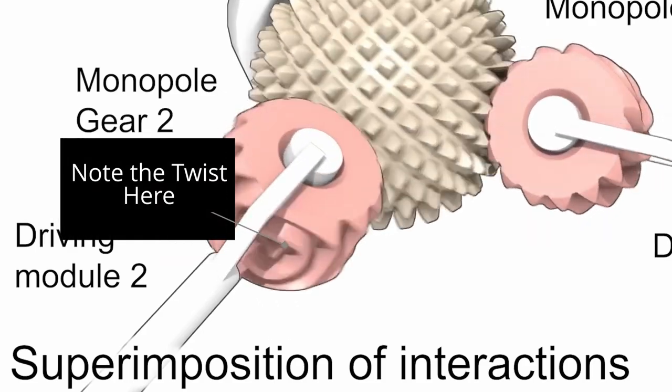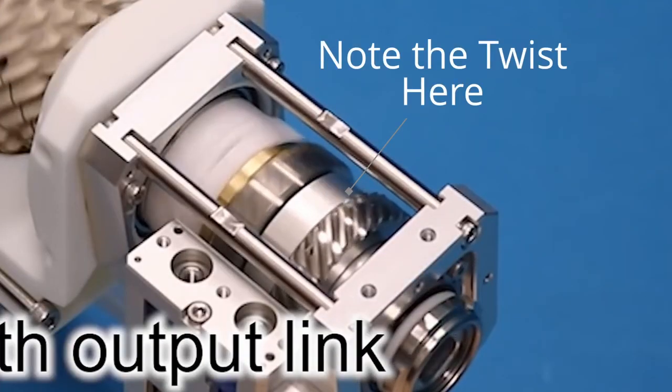Another thing that gives me a little pause is that depending on the angle you're going, it's going to really change how fast your gears have to move and how fast you need to turn. Because even in the design you can see where they had to rapidly swap back around to the other side. If you run a motion or pattern where you're doing that a hundred times an hour, you're going to burn this design out really quick and destroy the motor and gearing enclosure.